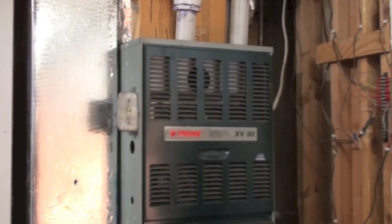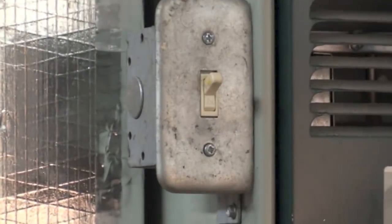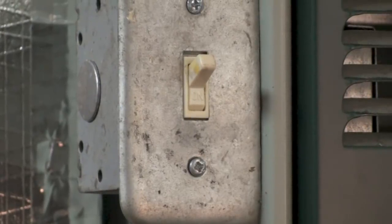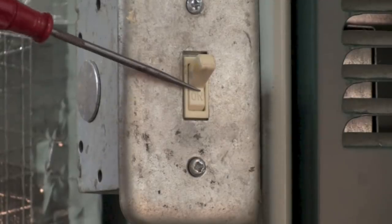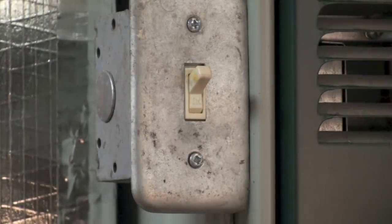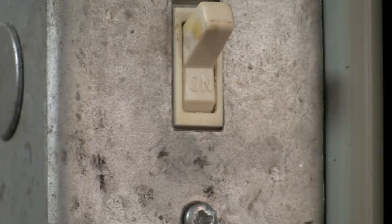But let's say it's on the side of the furnace. When I look at these switches, they're just a simple little switch. Now some of them will say on, some of them don't say anything on them. In the majority of situations, up is on. If the switch is up, it's on. It's not a breaker or anything like that, it's just a switch — up is on, down is off. Now there are some where somebody put it in upside down, but not much you can do about that except if it does have 'on' marked on there. If it's down, turn it up. Should be a couple of minutes before it starts — it may take off pretty quick, but it's usually a couple of minutes. Some thermostats do have a tiny delay built in, so it could be up to five minutes before it starts.